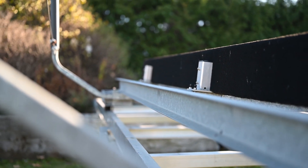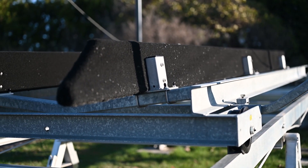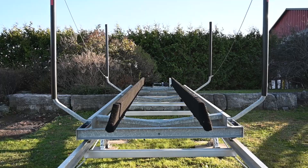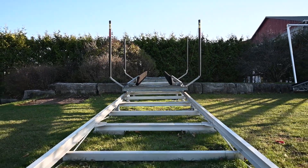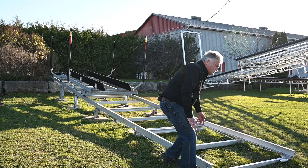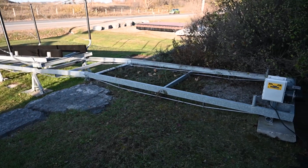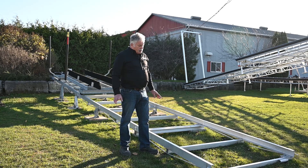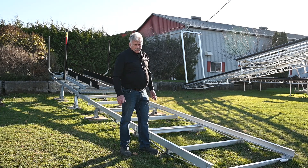With regards to tracks, we build our tracks in 10 foot lengths in both steel and aluminum. The aluminum lengths are available in 4,000 and 6,000 pound — they're very light. This is a 6,000 pound track at six and a half feet; with two fingers you can raise the track, making it easier to get in and out in the summertime. A 10 foot track in a 6,000 pound model weighs around 130 pounds, whereas in aluminum you're about 40 pounds.